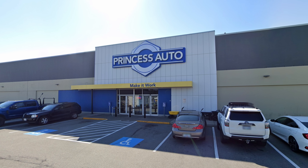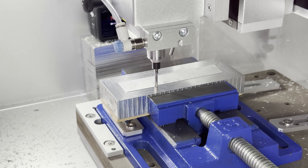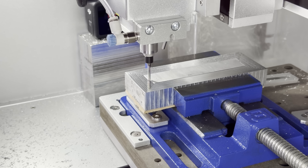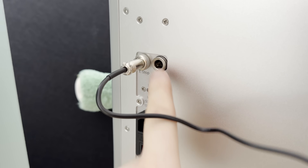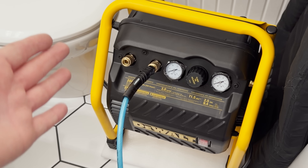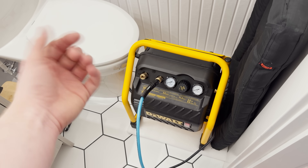The aluminum is a little bit thicker than the test project material, so I needed a better way to mount it. I went to Princess Auto — our version of Harbor Freight, cheap budget tools — and picked up this crappy little drill press vise for $25. It's good enough to hold the metal where I need it. There's also an air-in port, which supplies compressed air to blow all the little metal chips out of the way. I've been told chips of metal are not something you want staying where you're cutting. It also helps cool the bit, and since some cuts are going to take a really long time, cooling seemed like a good idea.